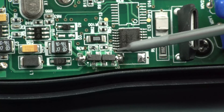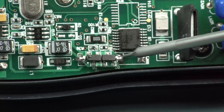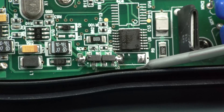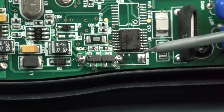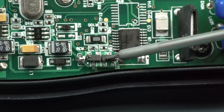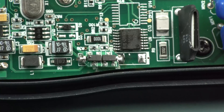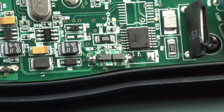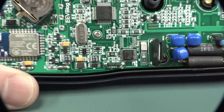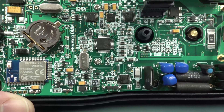In this particular case, we wanted to replace an SMB component with two SOT23 parts. As you can see, they don't quite fit side by side — you could stagger them a little bit — but because we actually had two adjacent pads, we can just have it going from that pad to that pad, no problems whatsoever. This is just a real simple example, but it gets the point across. It's neat and tidy, and it simply becomes just another part. In fact, if you zoom out of this, you're really hard-pressed to tell that's actually a mod board in there.